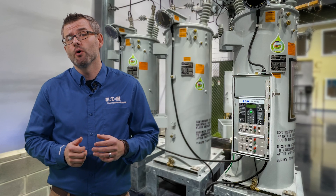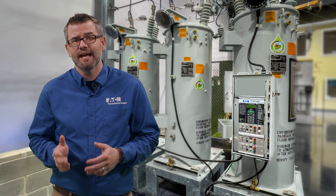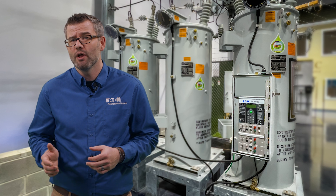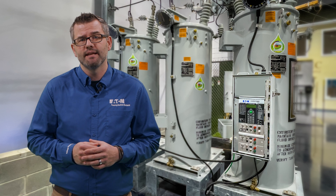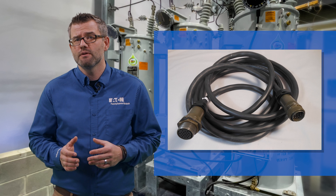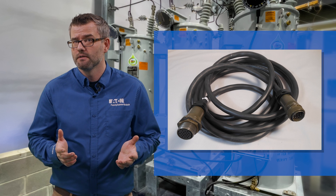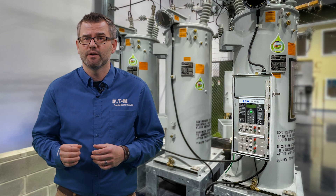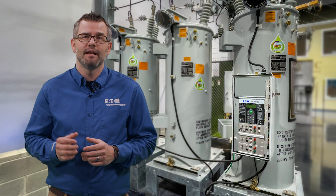The CL7 control can be retrofitted to any installation of voltage regulator apparatus, including Siemens, GE, Howard, Reinhausen RMV2 LTCs, Toshiba, and others. In fact, Eaton has tested and has solutions to integrate the control into nearly every tap changer made worldwide. With the 2018 publication of the IEEE C57.15 standard, an optional 19-pin universal interface was introduced to allow for the ease of utilizing different manufacturers' controls and regulators together. The CL7 control meets this optional standard utilizing a full control replacement assembly, or CRA, that has a 19-pin connection included.